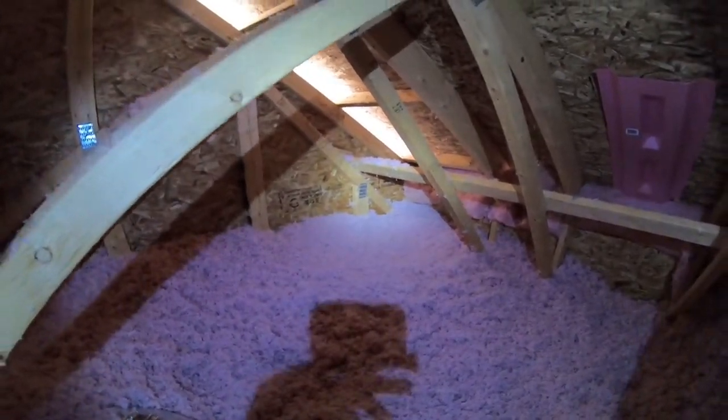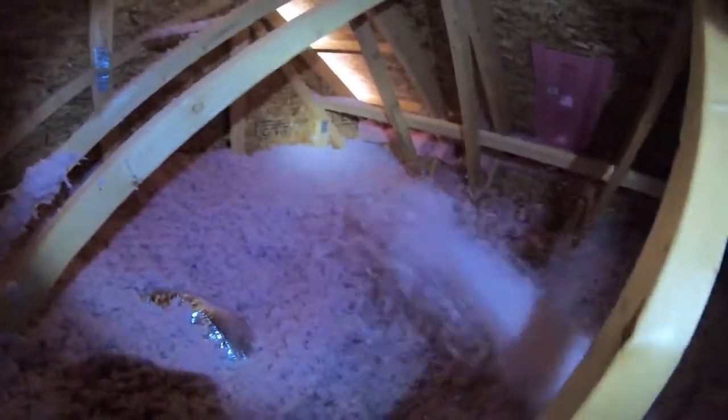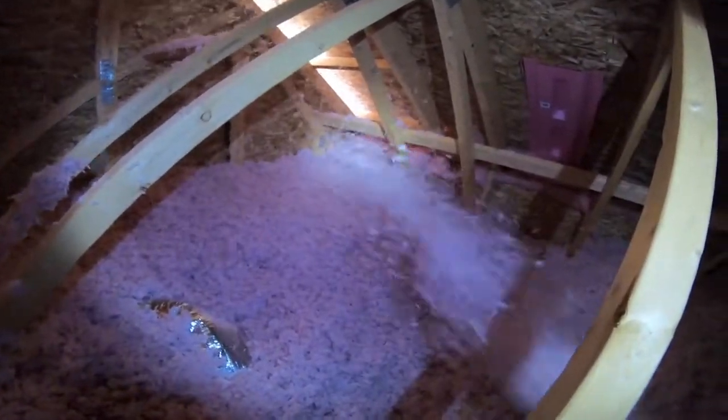Really stuff it in. The strategy I employ here — you can see the bottom of that plate on the corner — that's my 22-inch mark right there. I'm going to follow that across my exterior or gable wall. This connects to the other portion of the attic, but there are two attic hatches because of a separation wall. I think this is the loft for the garage on that side, but from the house perspective the second floor is completely continuous. I've got quite a bit to do here, but it's nice and open compared to the other one.